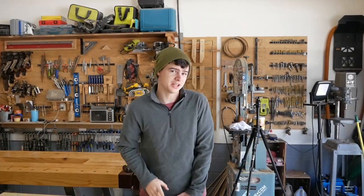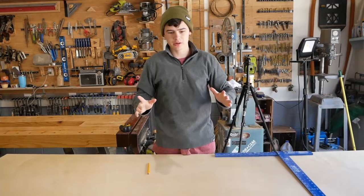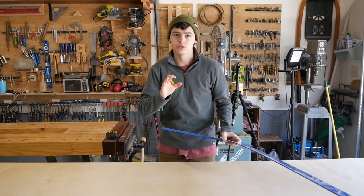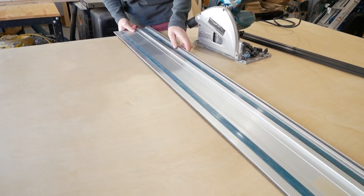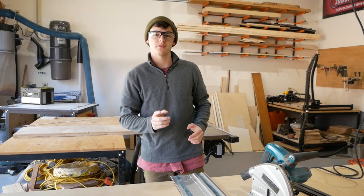The very first step is we're taking a full 4x8 sheet of plywood. It's very crucial that we get our measurements right. There's a link in the description below for plans. But we're going to cut this thing roughly in half to a specific measurement here, just to break it down and make the rest of the cuts easier. We're going to use our Makita track saw here to break the sheet of plywood down. It's pretty important that we get this straight and a good cut the first try.